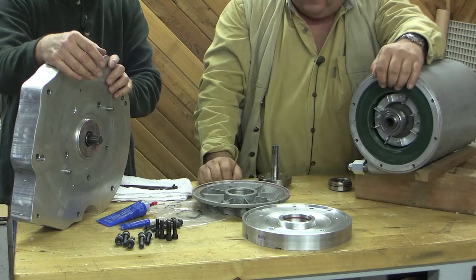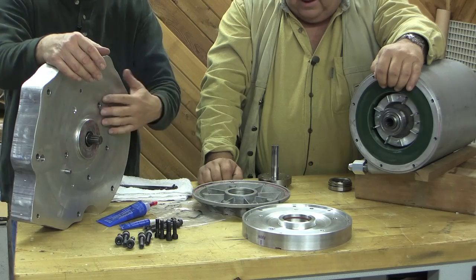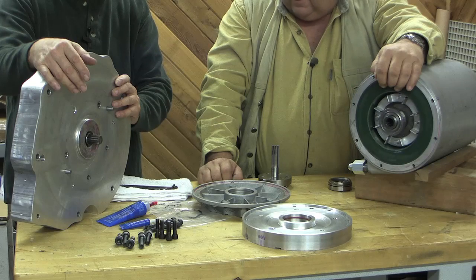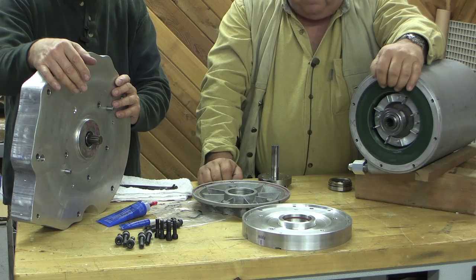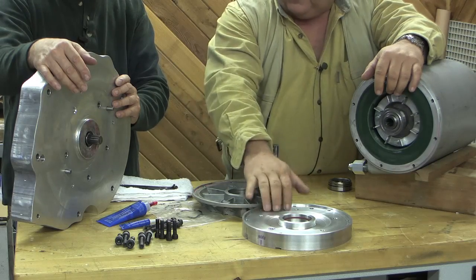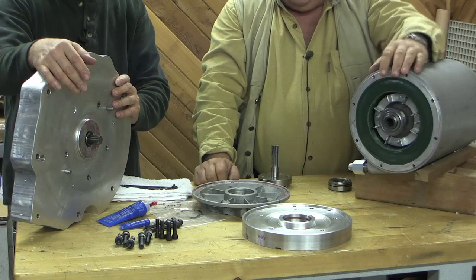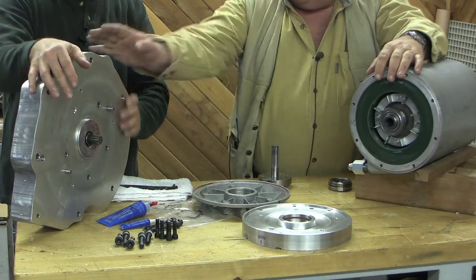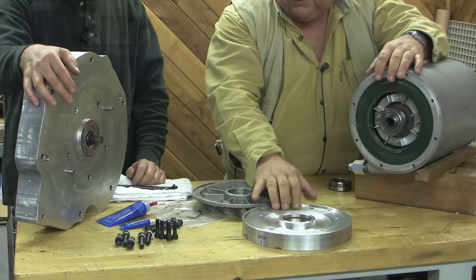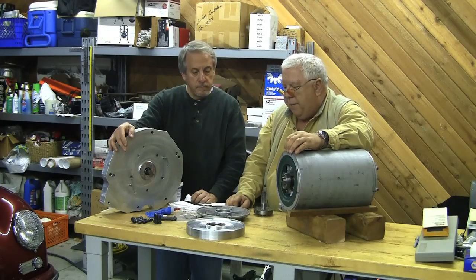I still think that was probably overkill. It's an awfully big heat sink, these two pieces here. The coefficient of heat — air being one, water being about 3,600, aluminum is about 250. That's not bad; that'll carry the heat away. It's very good at wicking away heat. And we have a massive thing here that it's going to be bolted to. This is much heavier than this, so we've got a huge heat sink for that bearing.